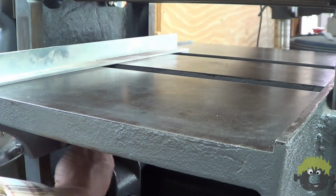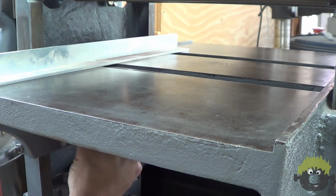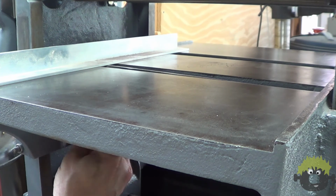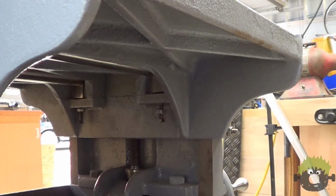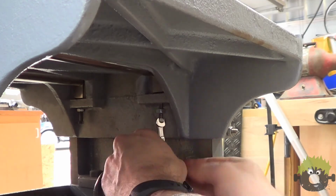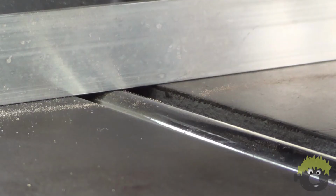Next up were the bed rollers. These should sit just barely above the table surface, just enough to lightly contact the workpiece as it's feeding. If you get them too high, the wood will tend to rock up and then down as it feeds through, and you'll get gouging from where the cutter head is cutting unevenly.